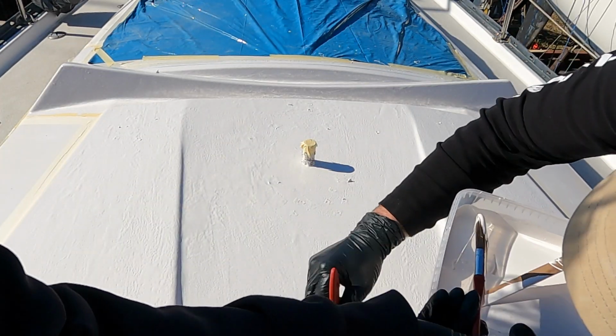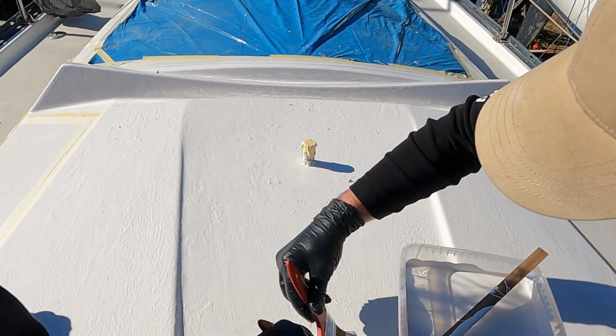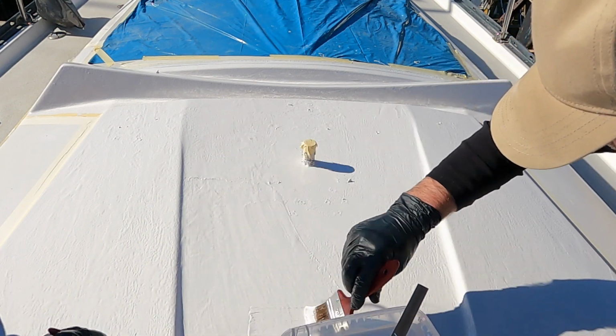We chose to paint in 3 layers. In the last layer there is wax in the gelcoat that makes it harden. Every time we do this, we wonder if it is possible to get the right finish in the end. It always looks bad before sanding and polishing.